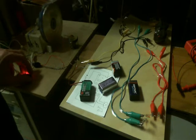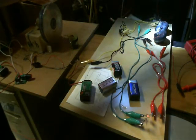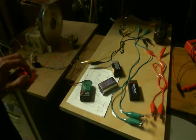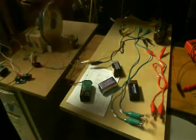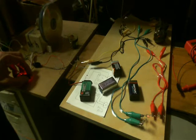What I'm trying to explain about the magnetic field being able to expand and collapse in those coils: to get the maximum amount out of there you've got to bring that timing to the right spot. Two things happen when I speed this up — the frequency of how fast it's moving isn't allowing that field to expand and collapse quickly enough, so you see the neon bulbs aren't even on. And the neodymium magnet isn't being interacted with either, because the fields are changing too rapidly.